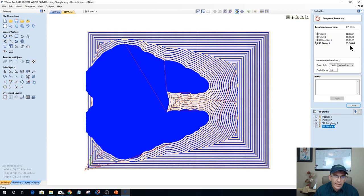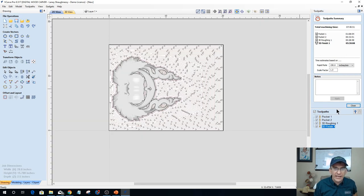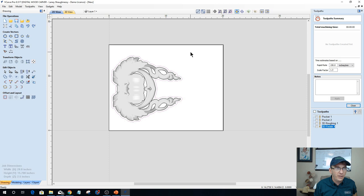So optimizing the toolpath saves quite a bit of time. I mean, we had 15 and some change, and we're down to 7. So we've basically taken off 7.5 hours by optimizing those toolpaths. And all we did was look at the flat areas of our part. There's no sense in our small little eighth inch ball nose doing this model and having to surface all of this material. So we drew a boundary around our material.